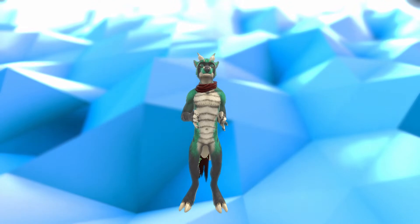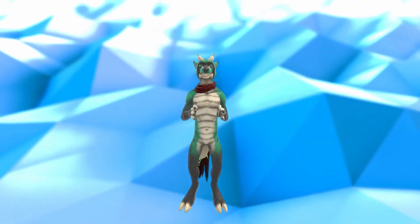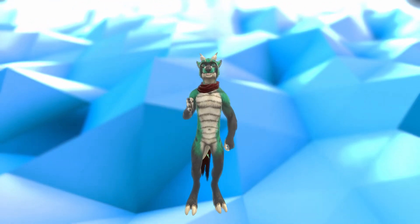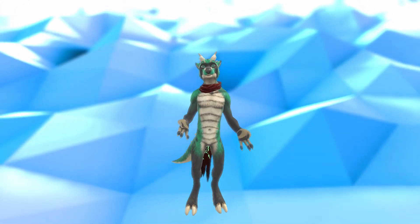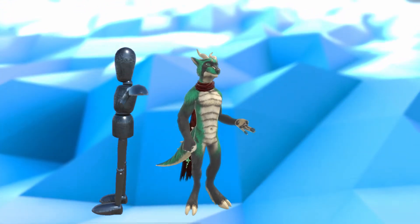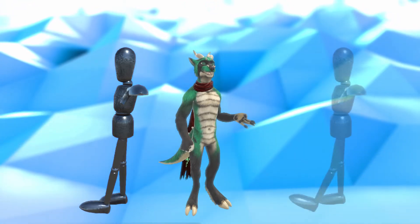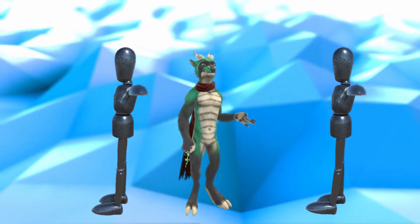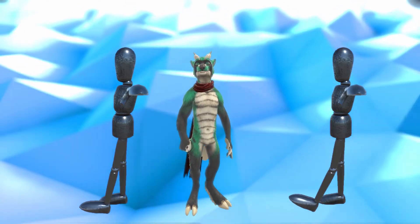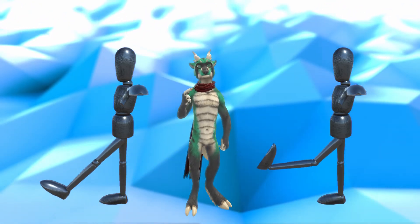The current obstacle I have to deal with is a bit of a gotcha moment. It's not as simple as simply tracking the sensor's rotations. The current problem is that the moment you lift your leg up, the other sensors also detect this change in rotation. Instead of the leg going directly up, we instead begin bending the knee backwards, which is not as intended.